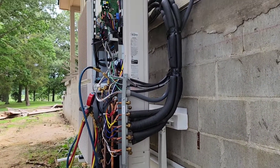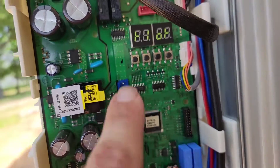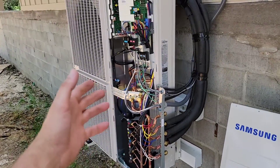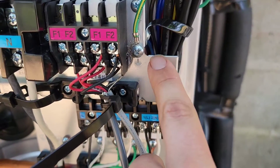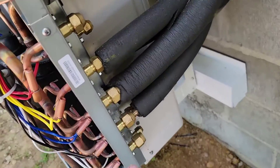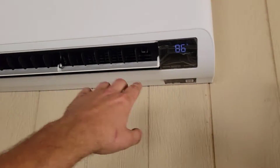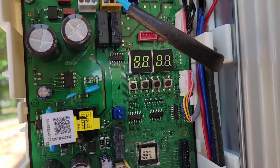Let's look at the auto address feature and pipe check. I push the K1 dip switch once and it goes into pipe check operation to find out how many indoor units there are. You've got to make sure your wiring is right and all the indoor units are grounded at the outdoor unit for the signal cable — those are the F1 and F2 wires, with line voltage powering the three indoor units on pipe connections two, three, and four. We're sending refrigerant in and the vapor line is nice and cool. The pipe check operation has ended and we're displaying 0, 1, 2, 3 — meaning all three indoor units are recognized.